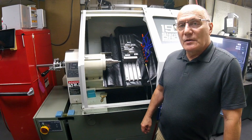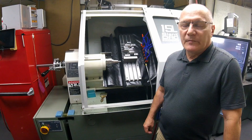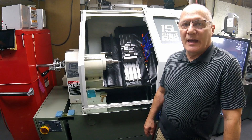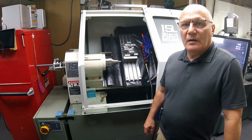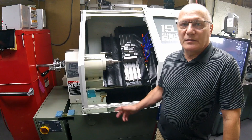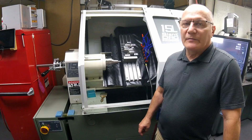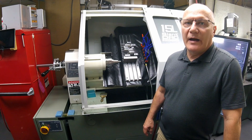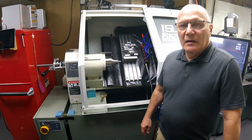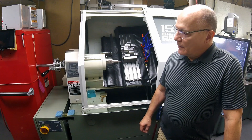If you're doing larger work, the additional torque you get from the reduction by the 2,500 RPM pulley is an advantage. The changeover mechanism that's there is totally impractical — not complaining given the machine cost, and it was nice they gave two pulleys — but in my work I could be switching back and forth in the same day between turning four inch diameter material and quarter inch diameter material. So I need to be able to go back and forth between the high and low speed range rapidly.